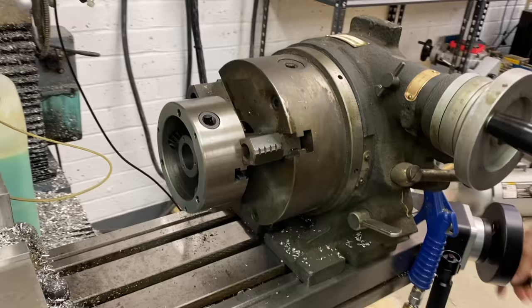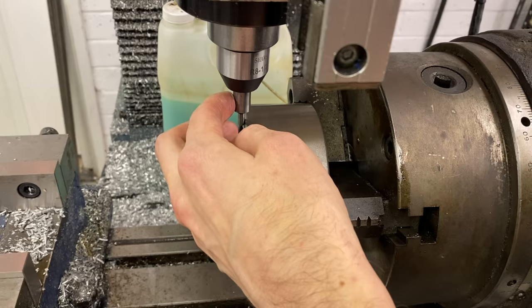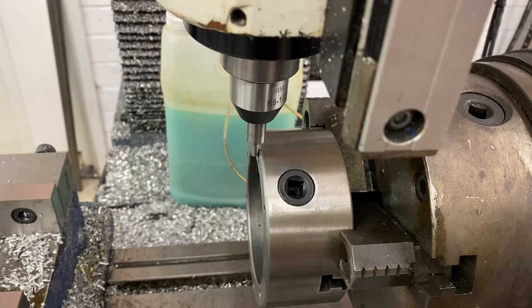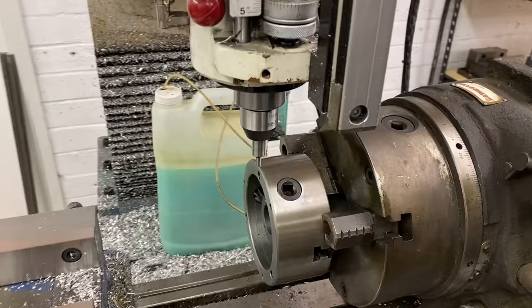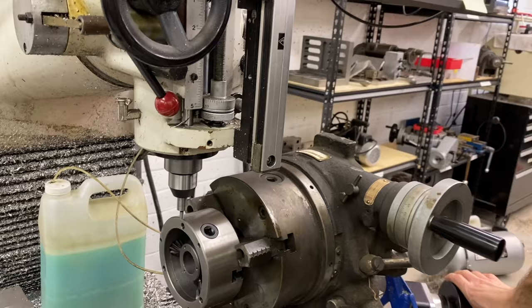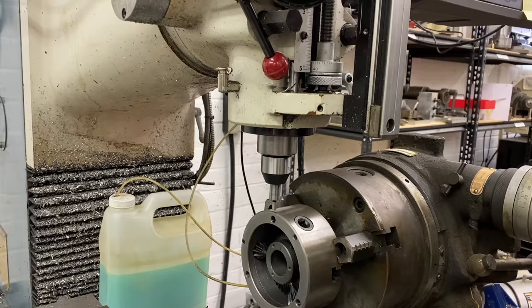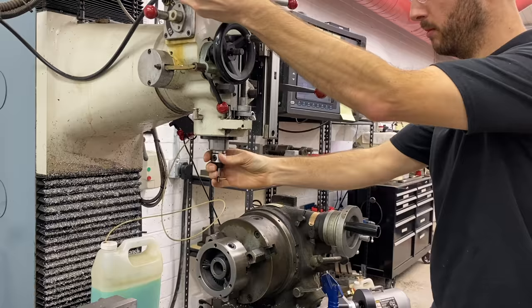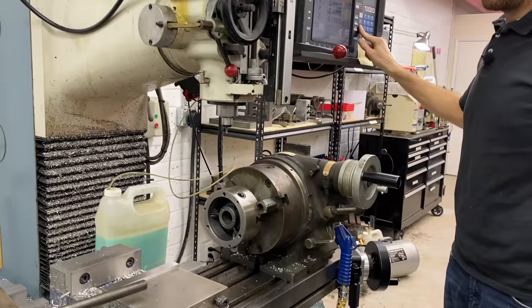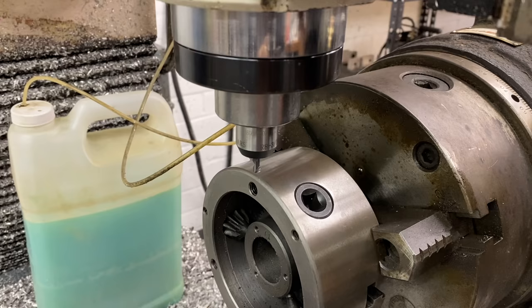The fixture is now aligned and we're just going to get our X position of the part. We're going to call that X.1 because we have a 0.200 diameter edge finder here. We'll go to zero — it's actually X.1 negative so that when we go to zero we're actually on zero. Visual confirmation just to be sure, and then we're good to go. Now we need to decide how far back we want these set screws to be based on how much room we have in our lip — 150 thousandths.